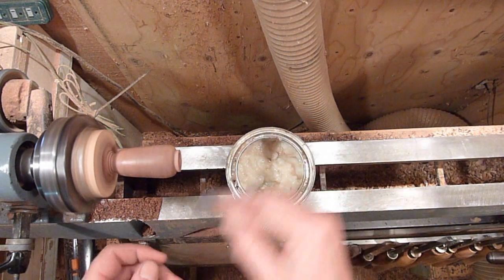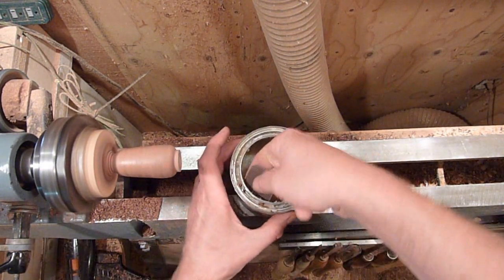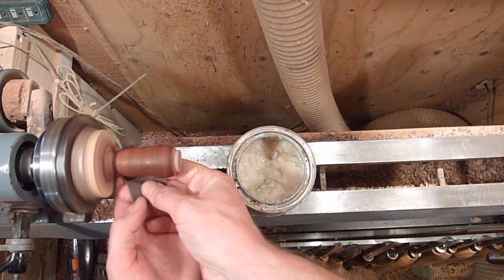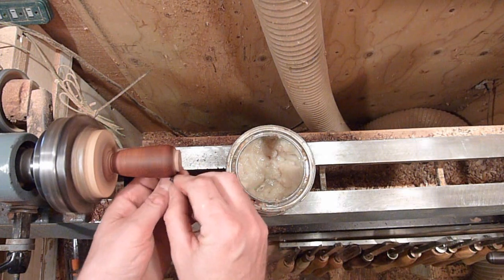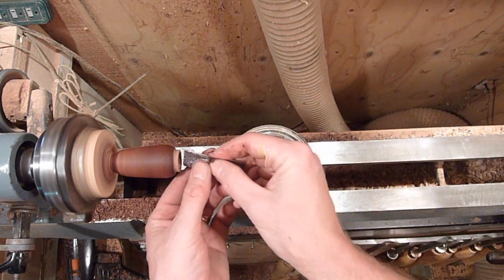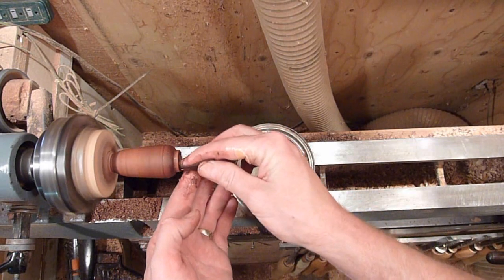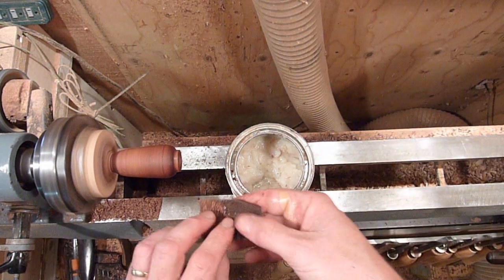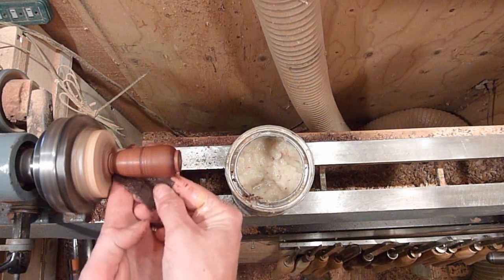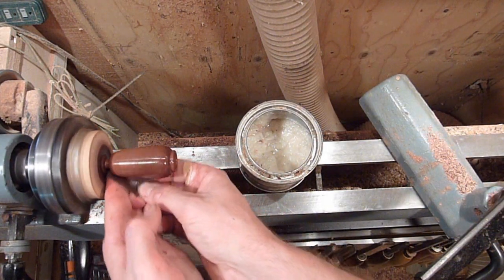This one's pretty small, so don't stick your finger in there if you're doing a small box like this. Don't try and sand it by sticking your finger in — put a little bit of sandpaper in there like that. Don't wrap it around your finger or anything. And again, don't sand that tenon either — the lid's already fitted. I think maybe I need to vacuum that out a little bit. Just finishing up with 600. Made it.